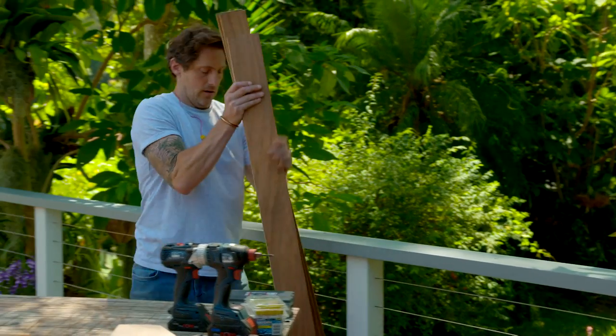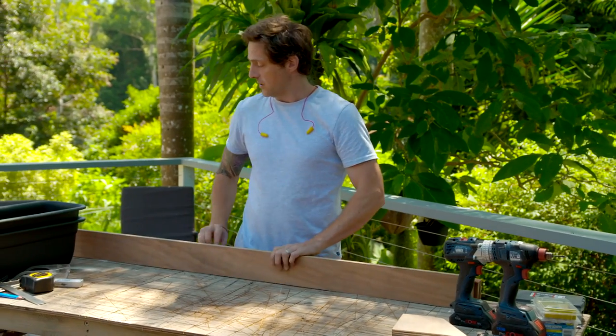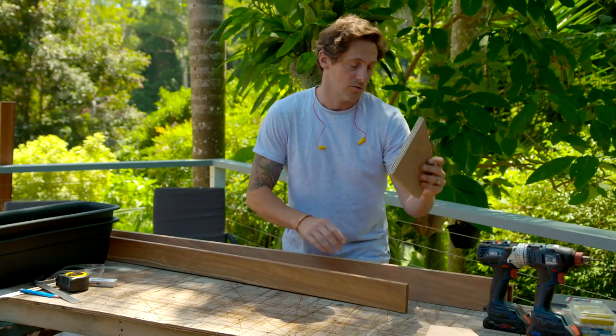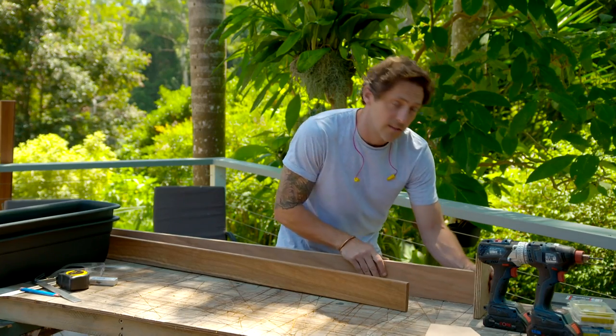On the front and back of our planter box, I'm using marine ply, and then on the face that you'll see, two stacks high of the spotted gum. It really simply just screws together with the ends you just cut. Pre-drill before you screw it, and it'll stay nice and strong.